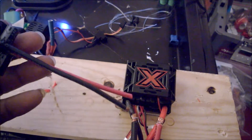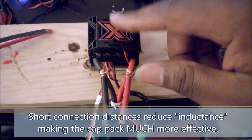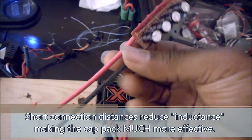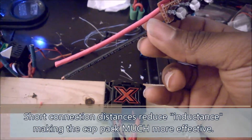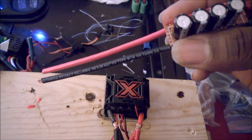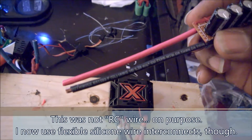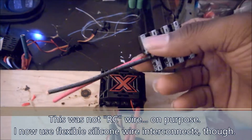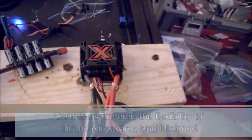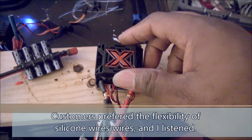The cap pack should be wired as close to the ESC as possible. The ones I build, I leave a few inches of wire — and this is low-gauge wire, meaning thick wire. This particular one has 10-gauge wire on it. I purposely use fairly stiff copper wire because I like to have these things hard-mounted on the chassis and not have the wires flapping around. The nice lightweight silicone wire is good but it tends to bounce around a lot.